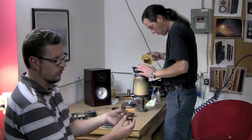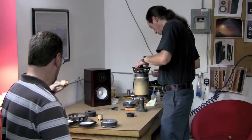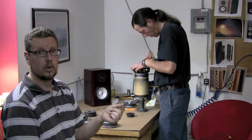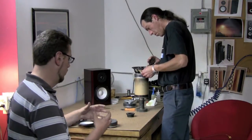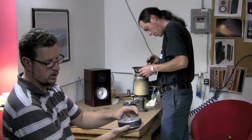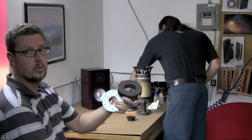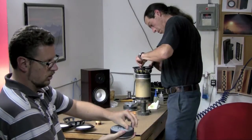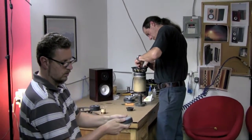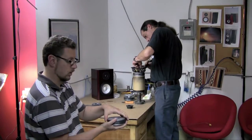The penalty of increasing the diameter and size of the voice coil is that the weight goes up. More weight means the woofer is going to have less output unless you compensate for it, and the way you compensate is by increasing the magnetic strength of what's called the motor. The motor consists of three parts: the top plate, a ceramic permanent magnet, and a T-yoke. All of these parts are significantly larger than our current 6.5-inch woofer, simply to overcome the additional mass of the larger voice coil.